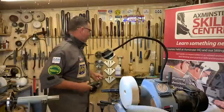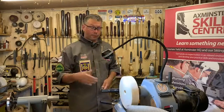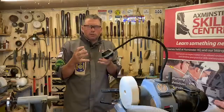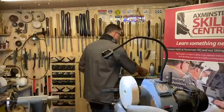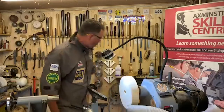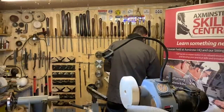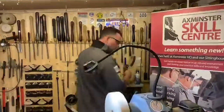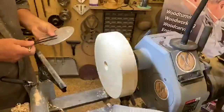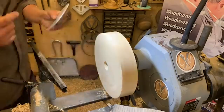Always when you retract, just make Charlie jump out of his skin. What that noise is, is friction. It's dry timber, vibrating in that hole massively fast. So you've just got to be careful, that's a horrible noise. Right, so I'm now going to make the diameter for the external grip on the jaw. There's my C jaw measurement there, using the speed sizer.